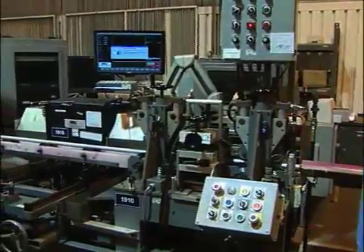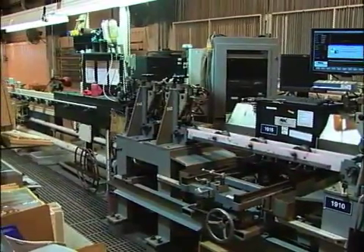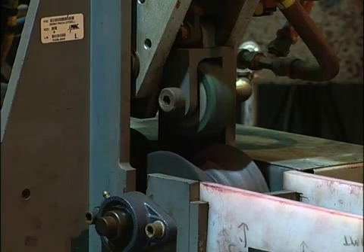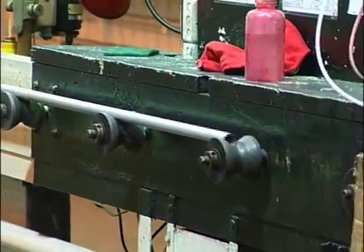Now the final pair of tests were eddy current and ultrasonic. Most of the testing that we do here is eddy current, but in some very critical applications, such as nuclear power plants, a customer will ask us to do an ultrasonic test as well. The eddy current test actually looks for little tiny short defects, while the ultrasonic test is very sensitive for more longitudinal defects. So if you have the combination of all those tests combined, with the addition of the air and water test, then you really have the ultimate testing for a nuclear power plant for high reliability.